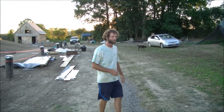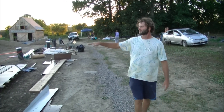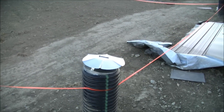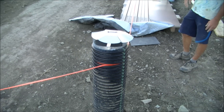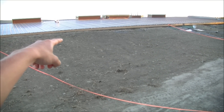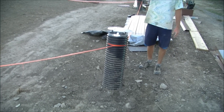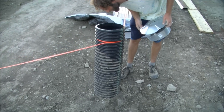Because it gets really wet in the spring here, the curtain drain will also help make sure the cooling tubes don't get any water in them. This is a cooling tube just like the regular one in another Earthship, but since they were on the hill they had to make it pop out this way. It starts from under the ground on the north side of the building and comes here — they used a 90-degree turn here, though a 45 was also considered. It's perforated at the bottom and it is dry in there.